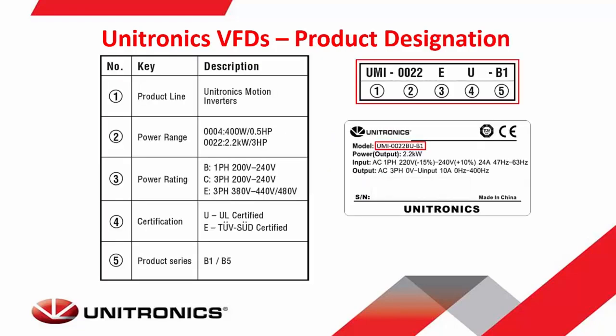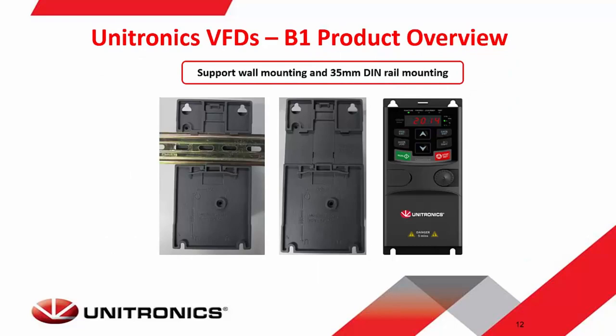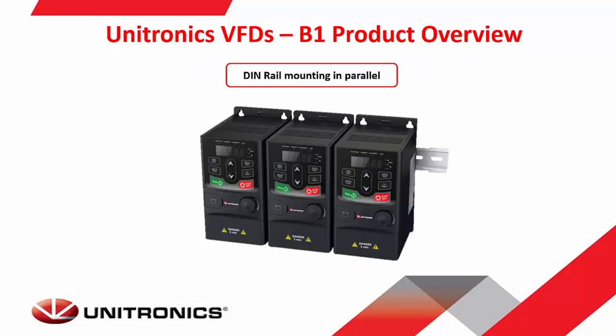When choosing a VFD to find your part number, you'll first use UMI for Unitronics Motion Inverter. You'll select your power range. For example, if you were to have 0004, that would equal a 400 watt inverter, which is half a horsepower. You'd then select your power rating for one phase, 220, three-phase 220, or three-phase 440. You then select your certification, U for UL, and E for our European models. And then your product series, either B1 or B5. The B1 models allow you to DIN rail mount as well as wall mount. You can see here a picture of them mounting in parallel.